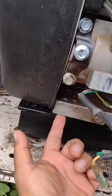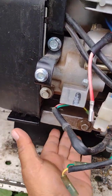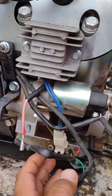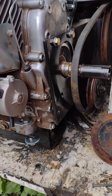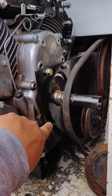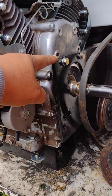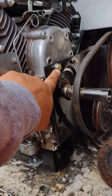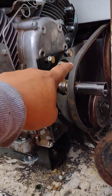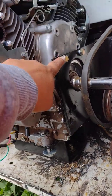I could not put this hole in on this side because this motor mount plate is missing — it's cut probably — but the other three bolts are in and I know this is going to hold. Why? Because this is the original plate that comes on this skid steer. Also, the first bolt lines up perfect with the motor. The second one will not, and neither will the bottom ones — you have to find those yourself.